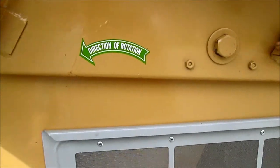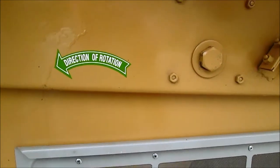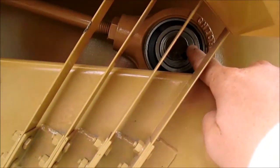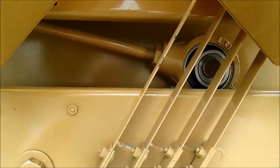One of the most important things when wiring up your gravity table: make sure your fans are turning the correct direction as indicated by your decals. Make sure your shaker shaft — because that is now split on a VFD drive and a one horse motor — is turning the same direction as your fan.